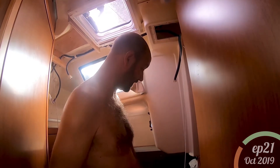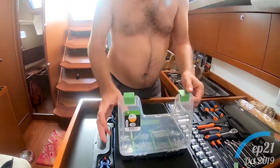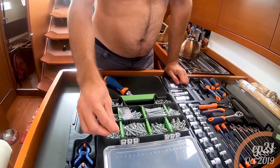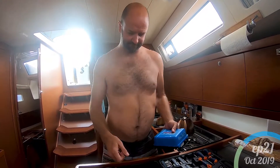In the meantime I'm going to mount the charge controller on the back of the battery bank. To operate at optimum, the charge controller needs to be within 5 degrees Celsius of the temperature of the batteries. So I'm going to mount the charge controller in the same compartment as the batteries and therefore they'll be the same temperature. I need four screws. Job done!